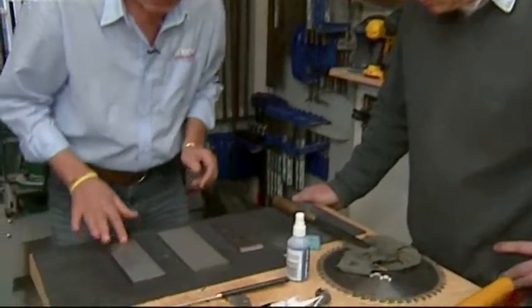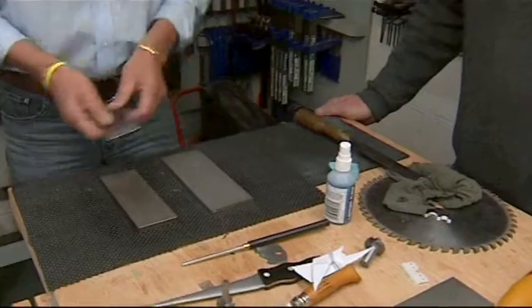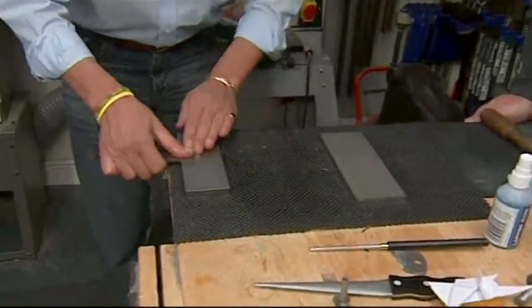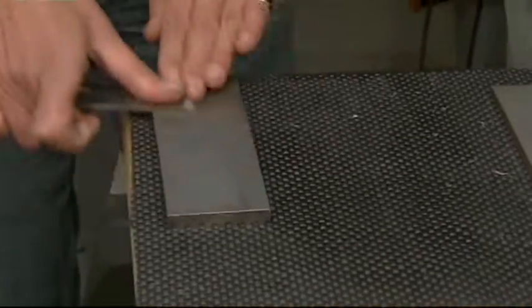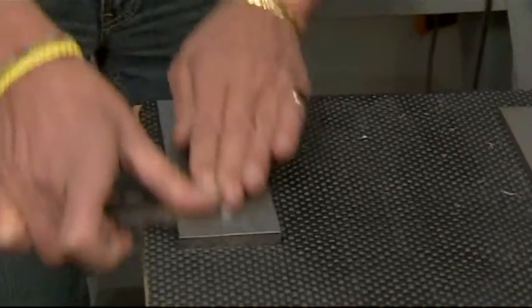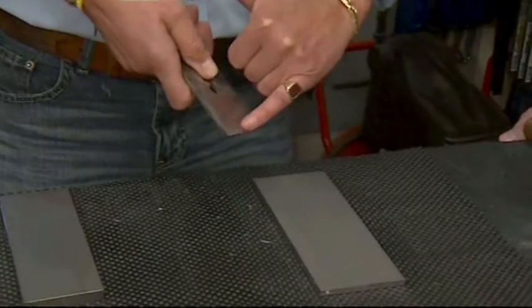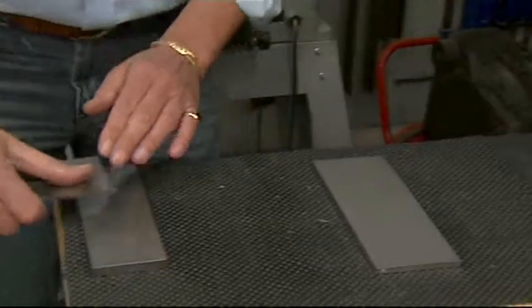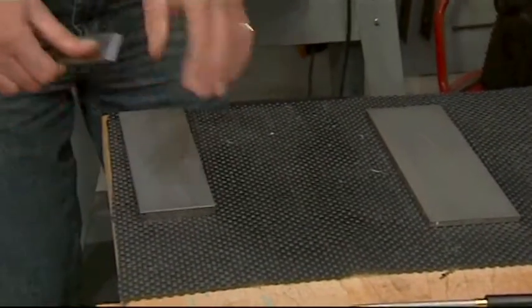On to your question as far as backing off is concerned — the beauty of a precision flatness surface is you can come on here and really find out how flat your tooling is. When you're backing these off, all you need to do is make sure it's flat across the back here; it doesn't have to be flat all the way up. So that is a great way to flatten that off.